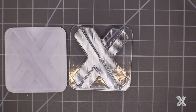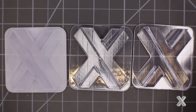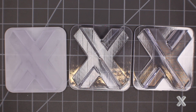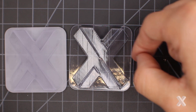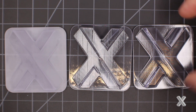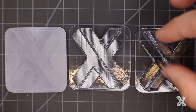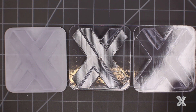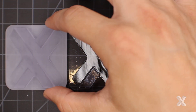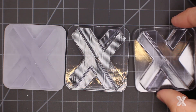Water clear is even more laborious but great for show models — it's like polishing headlights. We do sanding stage by stage, going from lower grit to higher and higher grit, removing features and layer lines as much as possible. Note that in tight corners it can be very tough to manually remove layer lines. Then clear coats are applied similar to quick clear, but by treating the surface layer lines I get much better clarity. This is probably the clearest you can get with SLA without heavy processing, though the difference versus quick clear is significantly more manual labor.